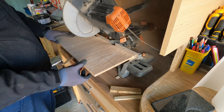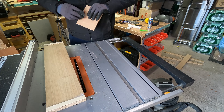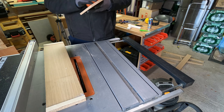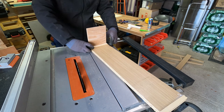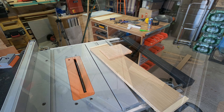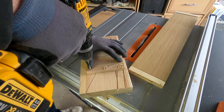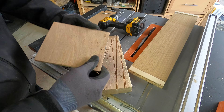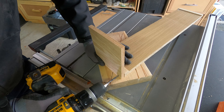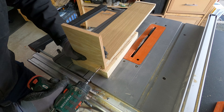It came to me that I could put a sort of end piece that wedges between the bar and the rail on the table saw. So I cut a piece of scrap 12mm hardwood and the plan was to drill and screw it to the end so it could fit in that gap, and do the same on the other side — wedged between the two. I pre-drilled all the holes quite deep because I was worried about the wood splitting.